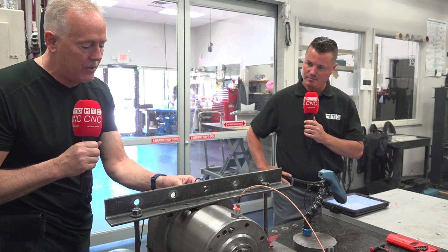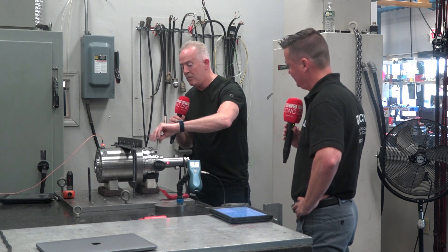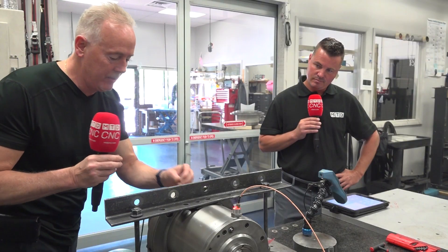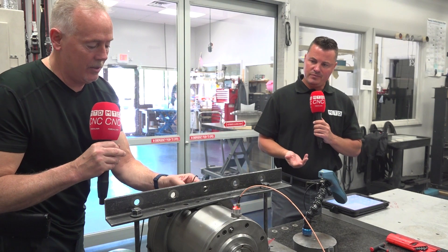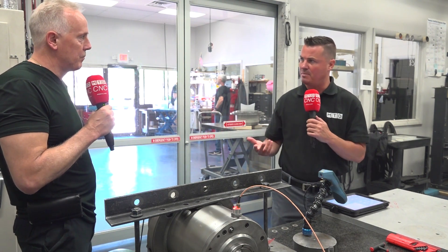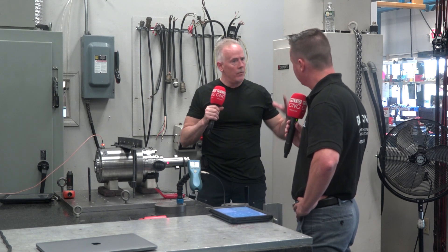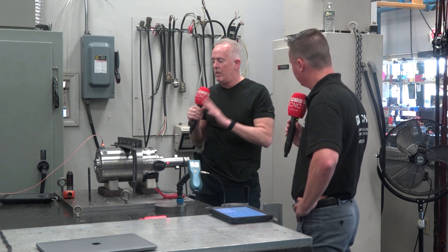It says correction weight at 0.21 ounces at 32 degrees. We take our trial weight out — as the word implies, it was a trial weight. I don't have a hole at 32 degrees; I have one at 20 and one at 40, so I'm splitting the weight between those two points to get the equivalent of the exact weight at 32 degrees. This software can absolutely be used at anyone's shop. Most spindle shops already have it — both Vibe Pro and Balance Pro were born in the spindle world, designed around high-speed spindles, though it works on fans, pumps, and motors too.